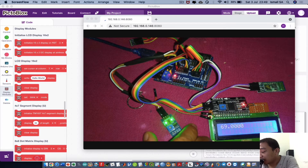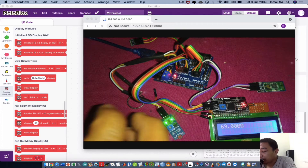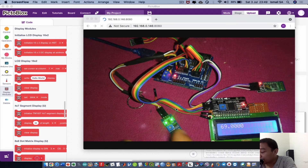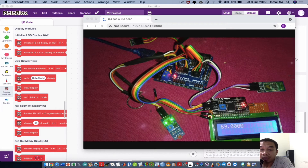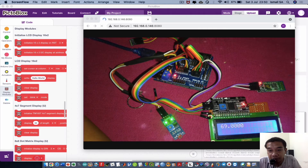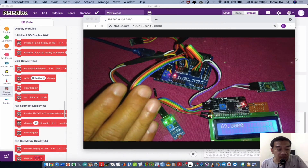Because there are no continuous intermediate values — only less than 70 or more than 1000 — this sensor is not suitable to be used with the analog read function as a true analog sensor. It only gives a value of approximately less than 70 or more than 1000, representing complete darkness or bright light. By knowing this, we can understand whether this sensor behaves as an analog or a digital sensor.